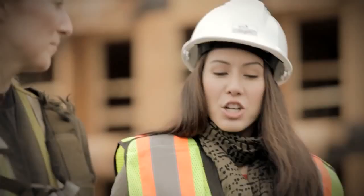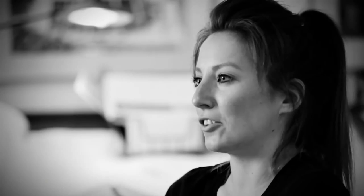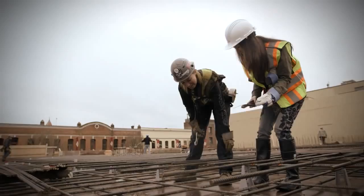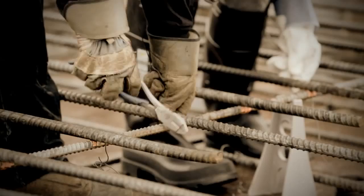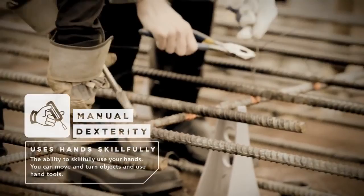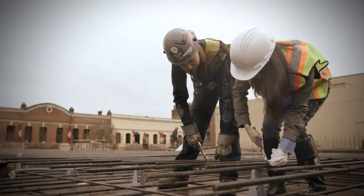So I've got a piece of wire and I've got a tool. That's our primary tool that we're using in rebar — those are called pliers. You're going to want to put that wire around the bottom of your carry bar right here. Grab that with the teeth of your pliers. You're going to cross over and keep twisting it in the same direction. This can be dangerous because you can break your wire.